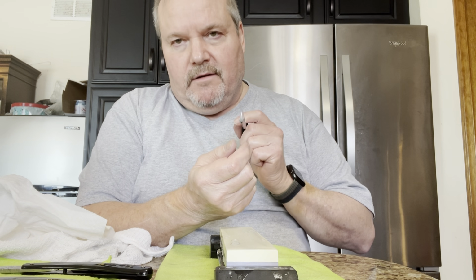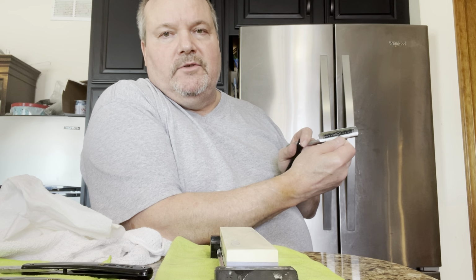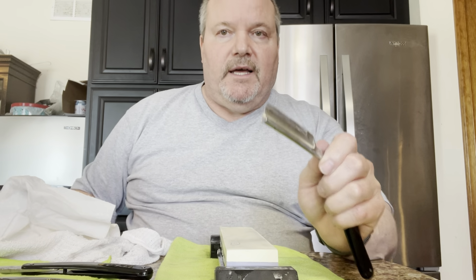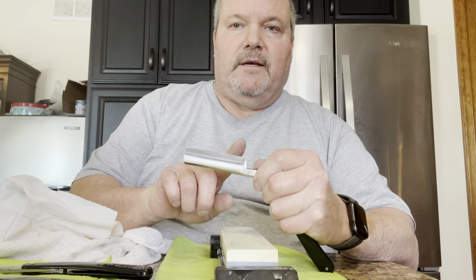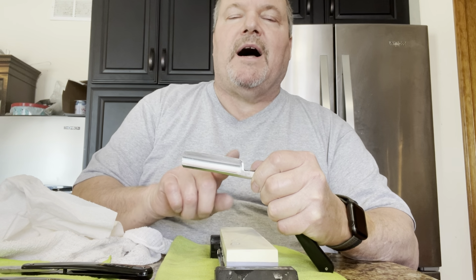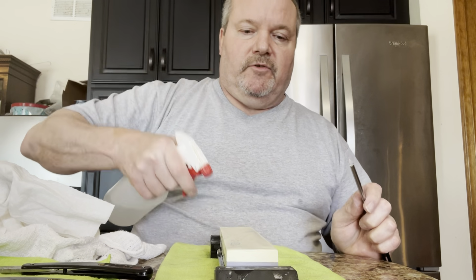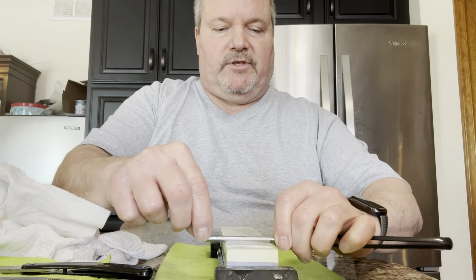Mathematically, when you go in there, you're grinding, and it becomes 1, 1, 1, 2, 2. So you would always be having a little less grinding time on the heel on that device. I've never measured them, I've never really looked at them. It just seems mathematically very possible that this part of the razor could have some amount less action on the grinder that's doing the basic profile shaping of the blade.